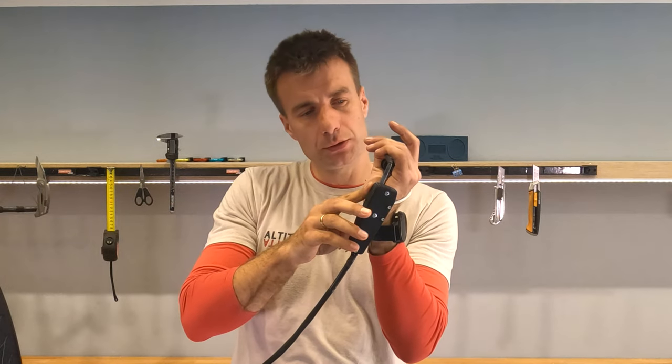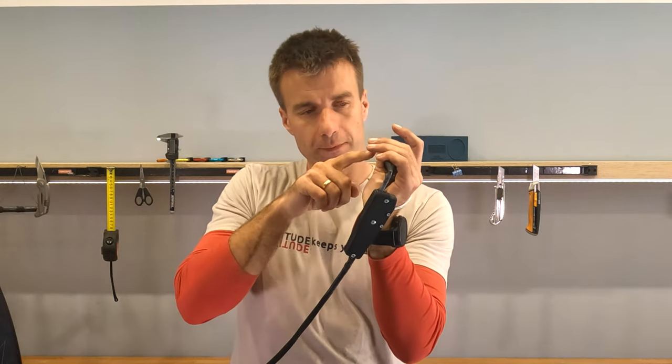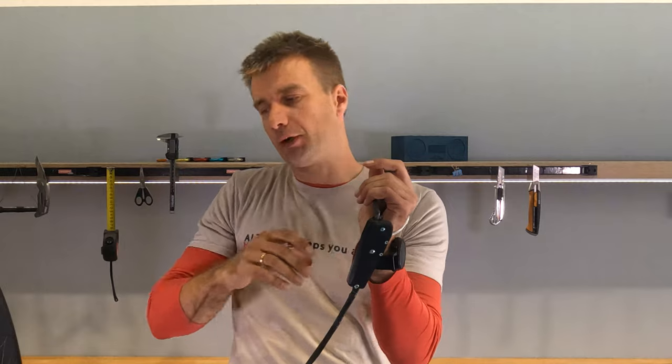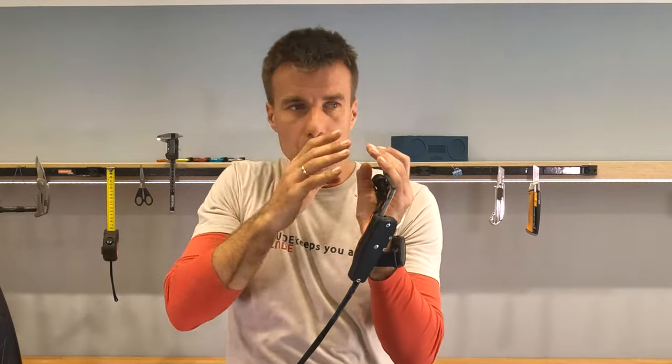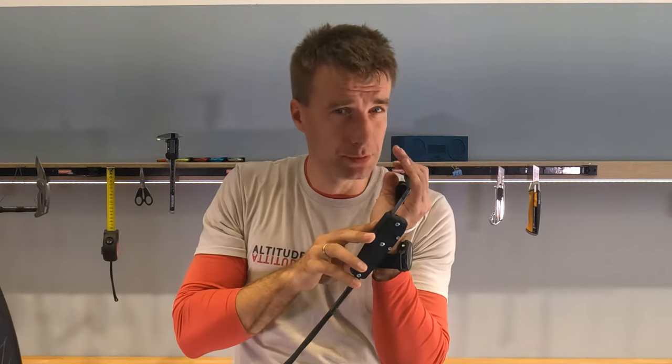But when I get to the mid-range, I pull 3 and it will be not 1, it will be just 0.7. And at full power, it will be 1.3 again. So you have the smoothest dosing of throttle in the mid-range. So when you do level flight, like foot drags, and you need to dose the throttle very, very precisely, you can do very minimal changes on the throttle, despite relatively large change on the fingers. So it will be a lot smoother to dose the throttle.